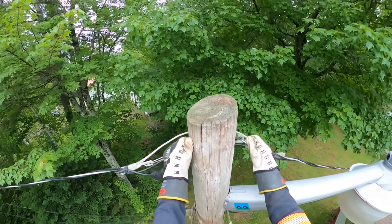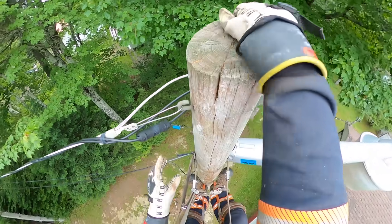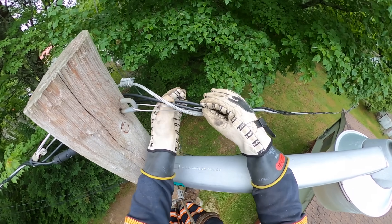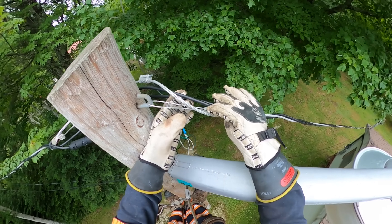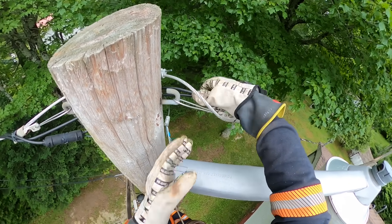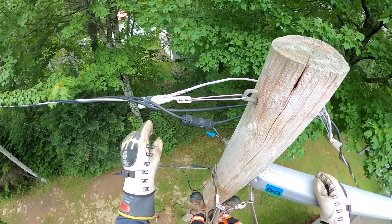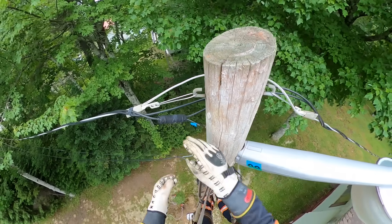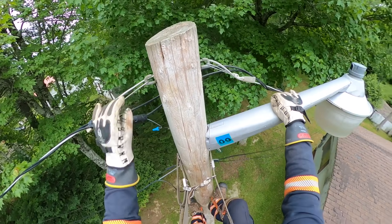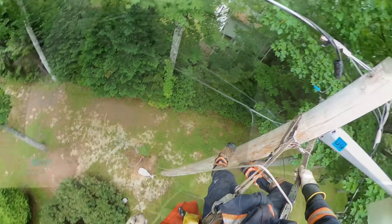All right, let's get our 1kV rubbers on. First thing — a quick inspection of the live lines. There are often bare spots around the connectors, so you want to check that carefully. This area here is jammed up tight against that neutral, which is a sharp edge. Everything looks to be in pretty good shape though — no bare spots, and it's not jammed tight against the neutral. So the first thing we're going to do is clip that line live off to start working on the street light.